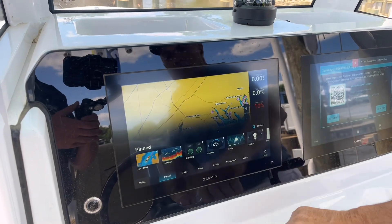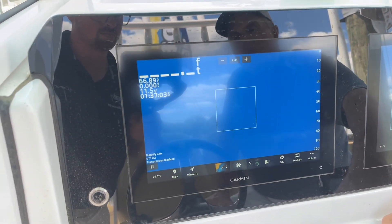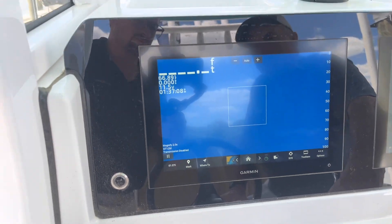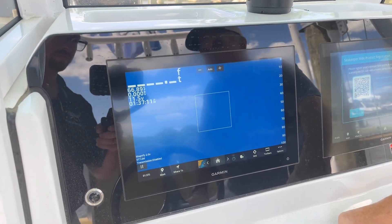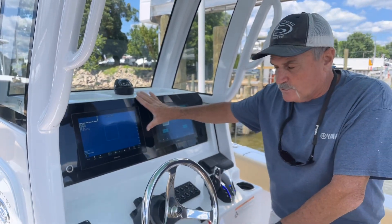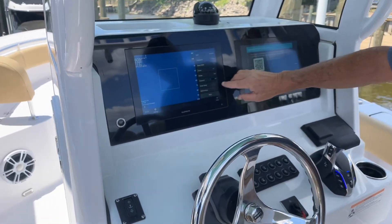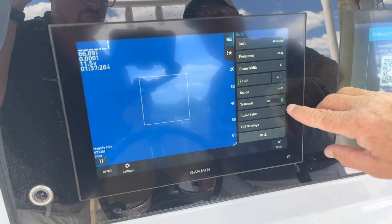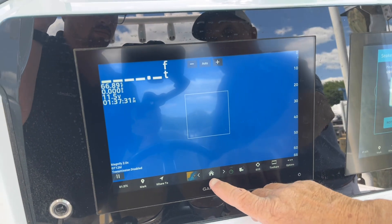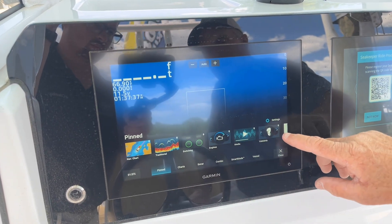Next, let's do your fish finder. Right now it is turned off because we are up in the air on a lift, and this fish finder will in a couple of hours burn out the transducer if it's not down in the water being kept cold. So the way to turn this off if you're on a trailer or on a lift and working with other components: go to Options for this screen and hit Transmit Off. Now we're not worried about the sonar being damaged by being out of the water while running.